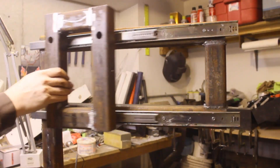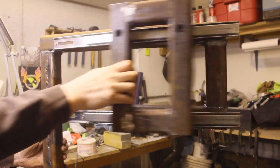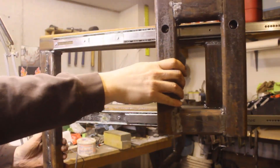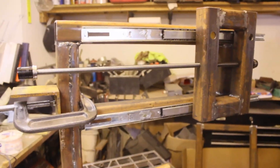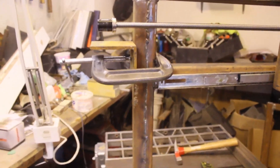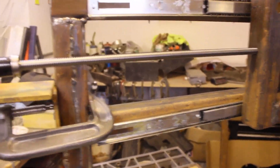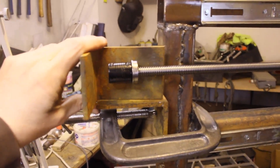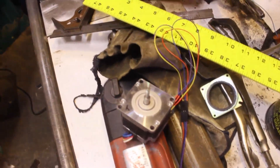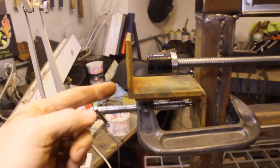I had a little piece of dirt in the track there and that was causing some pickup, but I'd say we are super smooth right there. Quick look with everything in place — or getting into place anyway. I've got a piece of angle bolted in place here, and I'm going to do another piece either like this or like this to catch the stepper motor. So I'm going to go ahead and drill holes for this and figure out which orientation I want.